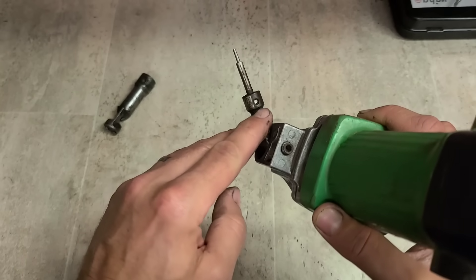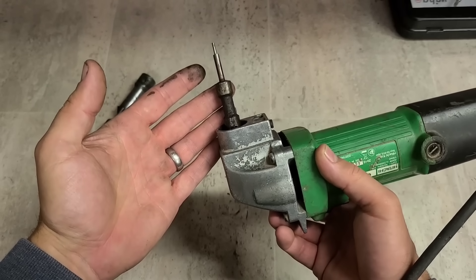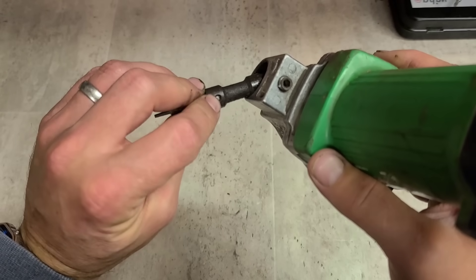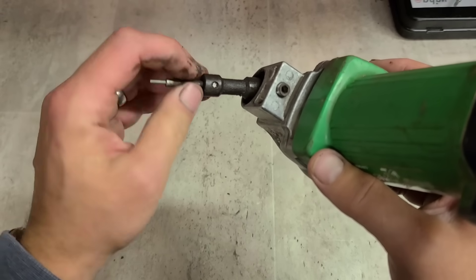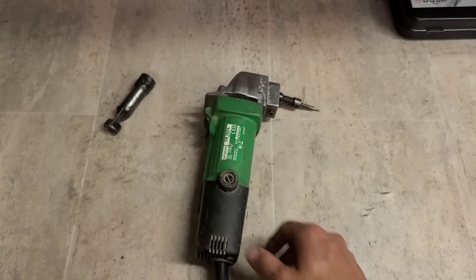So can't get this out. The only way to fix it is to replace this piston. Even drilling is no longer an option because the head snapped off - that's hardened steel, you'll never get a bit to bore that and keep it centered. Best thing to do is just replace it.